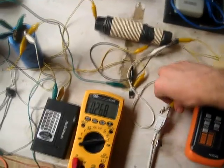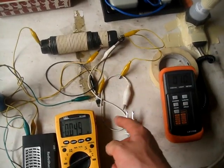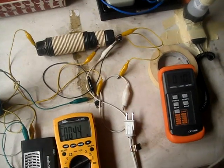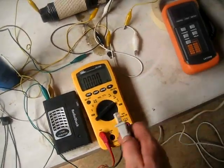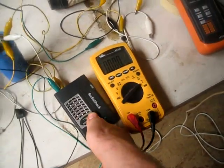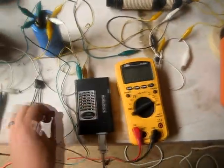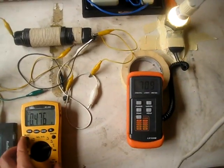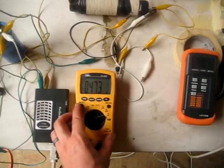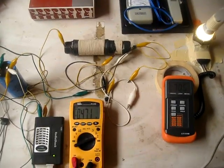Switching back to the traditional inverter — you can see that the Jewel Ringer with no load is drawing 45 milliamps, so it's still oscillating. Let me disconnect it — there we go, now that's turned off. Plugging back in over here... and we're back up to 708 on the light meter and 472 milliamps. So that's the reason, folks.